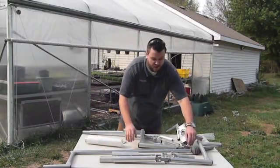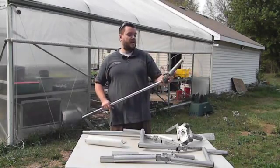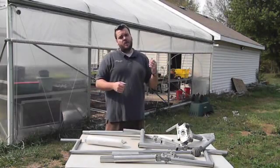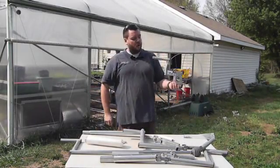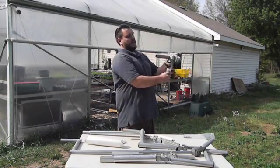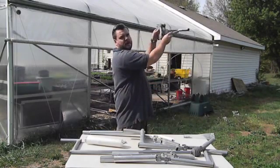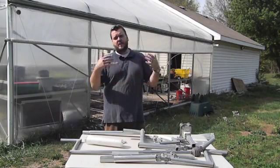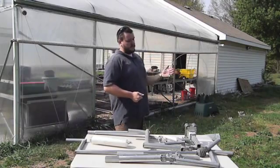There are also a lot of crank variations. For example, an Amish man had taken a universal joint off of an automobile so they could have a crank on one side using an American-made universal joint connected to their roll bars. For long buildings with a lot of weight in the roll bar, you can also get some mechanical advantage — one setup used by some Amish out of Ohio uses a gearbox with either an 8-to-1 or 13-to-1 ratio, mounted on a guide pipe so the whole mechanism travels up and down with the roll-up sides. Typically for long buildings we just put a crank on either end — for example, a 144-foot building would have a 72-foot roll-up side from each end.